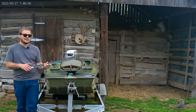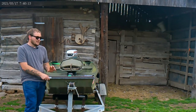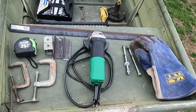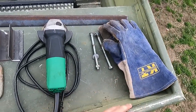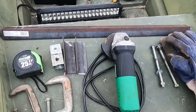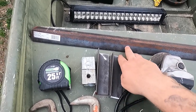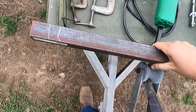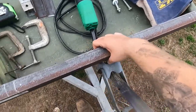I have a piece of angle iron here. I'm going to have it mount on the front, and my light bar is going to attach on top of this. We're going to show you all the parts we got. Tools you're going to need: I just got two little C-clamps, a measuring tape, an angle grinder, and some gloves because you're going to be handling metal with sharp edges. I also got a small welder in the shop that I'm going to use to weld that angle iron together. I started out with a four-foot piece of inch and a half angle iron and cut it down to fit the front of the boat.